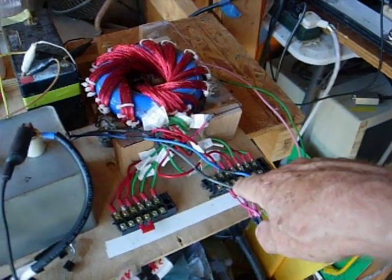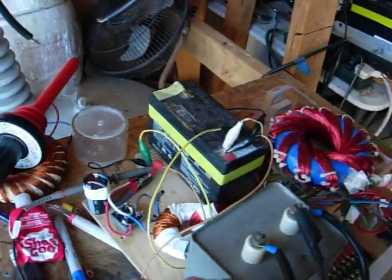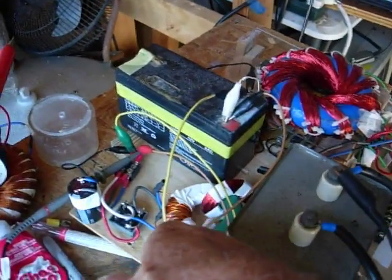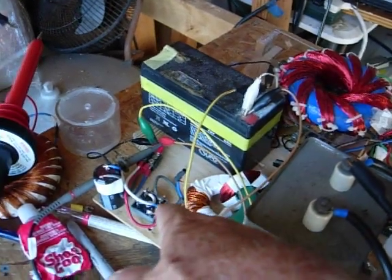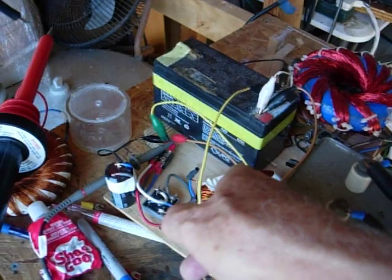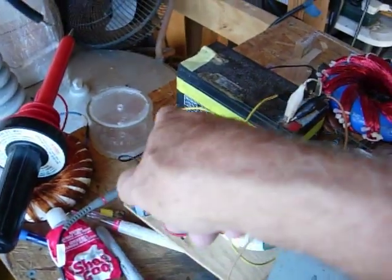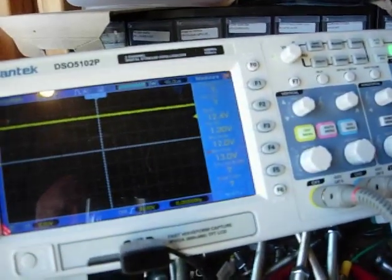There are 790 volt spikes coming out of those two that go back over here to a ceramic donut step-down transformer — about 210 turns to 50, 17 gauge on one end and 26 gauge on the other. That goes to a bridge rectifier diode back to the battery.